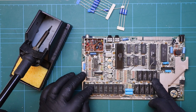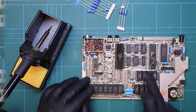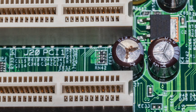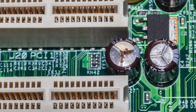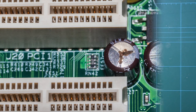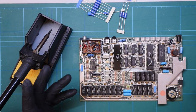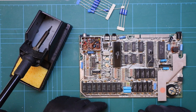We are instead going to carry out some proactive maintenance on this issue 2 board and replace the electrolytic capacitors. Like batteries, ancient electrolytic capacitors are bad news for old electronics. They can either dry up or, worse still, ooze their contents across the board and cause huge amounts of corrosion to the PCB. Thankfully, modern replacement capacitors are available online as complete sets — I got mine from Retro Revival on eBay, link below. Like the originals, these are axial packages so they will fit straight in. This job is fairly straightforward and can be completed in just an hour or so, so let's get started.